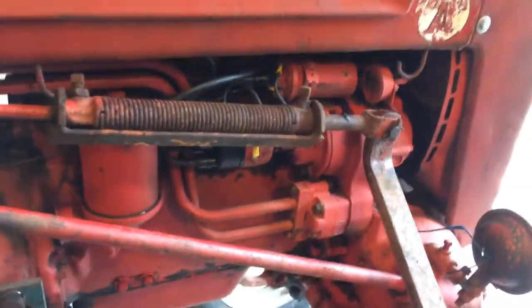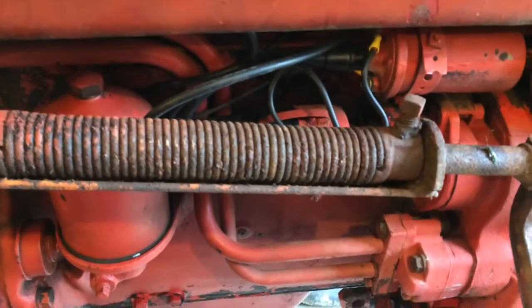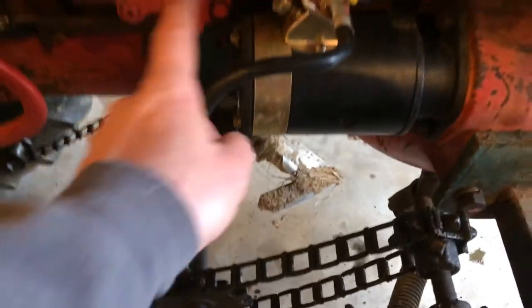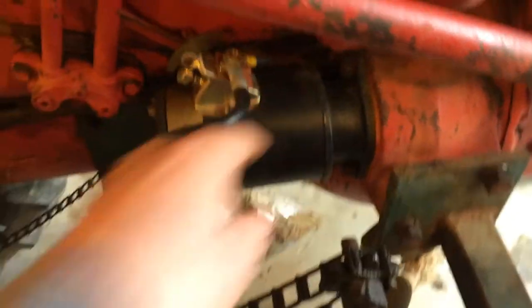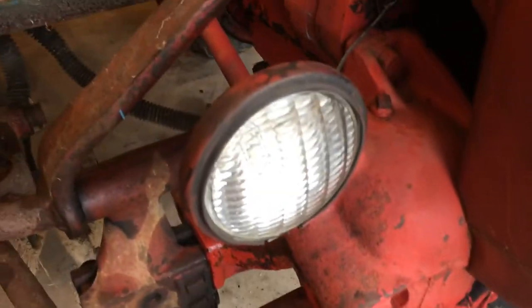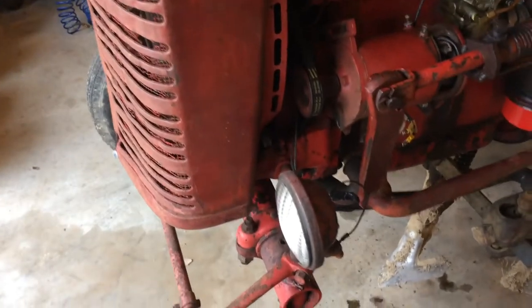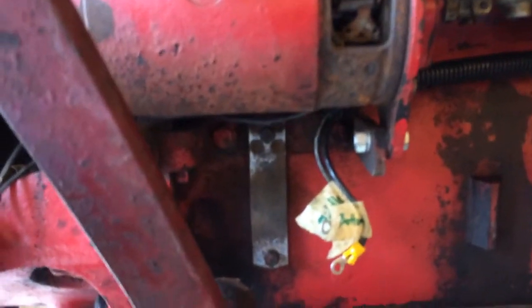This is going to be a quick one. We're going to change out this coil. The plug wires and everything are brand new on it. The distributor's been kind of tuned up a little bit, so that's all in good shape. I got good cables for the battery so I'm going to reuse those, and I got a good switch on my starter — that's been replaced recently. Brand new wiring coming down here, so I'm going to be able to reuse some of this wire, but change out the voltmeter and coil. The lights are also going to have to be changed out — 6 volt lights will not convert to 12. You'll blow the bulbs; I've heard the bulbs will actually pop.